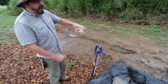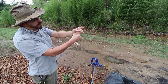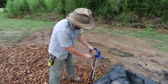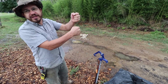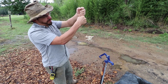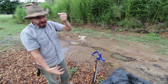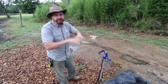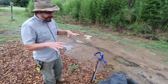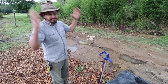The way that works is on the bottom of this hydrant there's a pipe, and there's a ball that fits into the inside of this bowl. When you open this up, it's closing that up, and whenever you close it, the ball releases, so all the water that's filled in here drains down, which is why you need to have gravel, so it all can percolate down. We don't get a lot of freezing, but last winter we got down to 0 degrees, and if you'd have left this on, it would have just exploded, splintered into pieces.